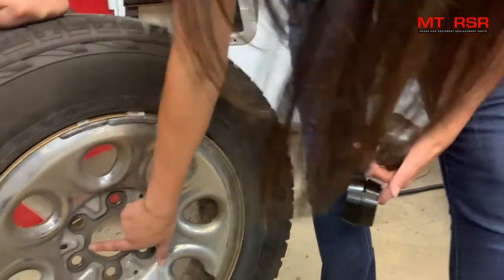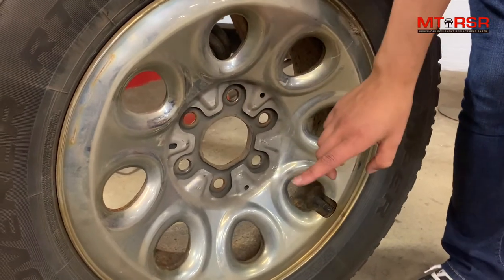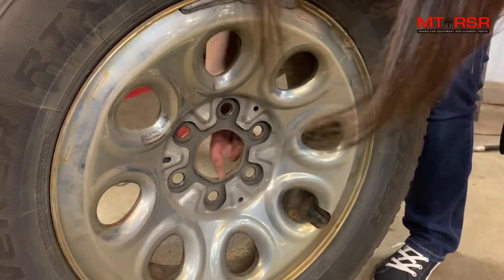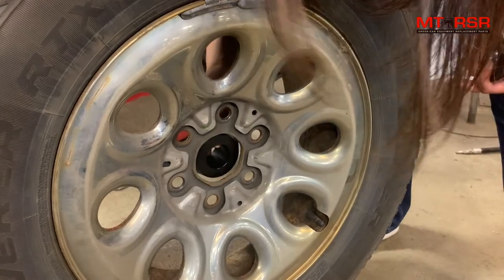When wheels are clad wheels, they're a little uneven right here. Sometimes on the bigger trucks you have kind of an indent right here, and you go to back mount your cone and you're bottoming out before you even hit the center. These low taper collets will fit in any of those wheels.